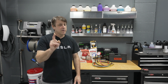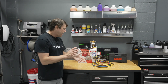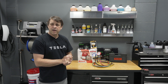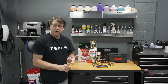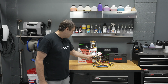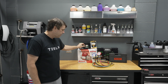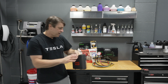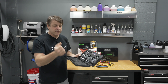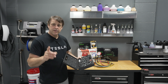I'll put links in the description for all these things. I didn't show it on my video, but I did do a full evacuation after getting the line set hooked up — I put the pump on it, drew it down to under 500 microns. It took a couple of vacuum pulls to get it to stay there, and it stayed under 500 microns for 12-13 hours. I was confident that all the water and moisture was out, contaminants were removed, and there were no leaks. You're going to need gauges, a flaring tool, Nylog, a pipe bender, and a torque wrench specifically for air conditioning. This copper is super soft — you go yanking on it, you pinch that flare fitting, and it's going to leak.